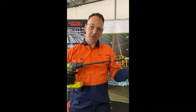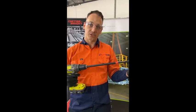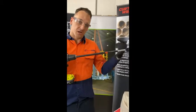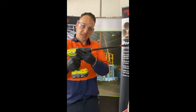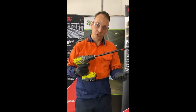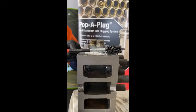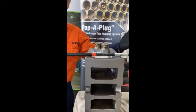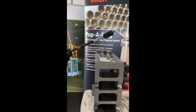The brushing step is critical to make sure there's no leak path, the tubes are rounded to suit the plug size, and that we've mechanically keyed the surface for a better connection. What people tend to do is force the brush in, which can cause deep grooves in the tube sheet or a tapered section in the tube. Operators need to let the brush do the work, easing it in back and forth for at least 30 seconds on hard alloy tubes including carbon steel. We've got a depth gauge to make sure that we don't go past the tube sheet area and start brushing out the tube.